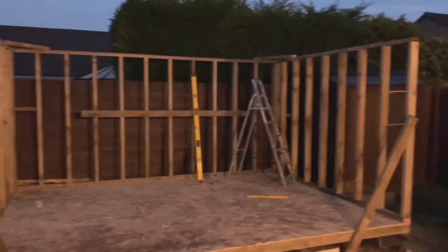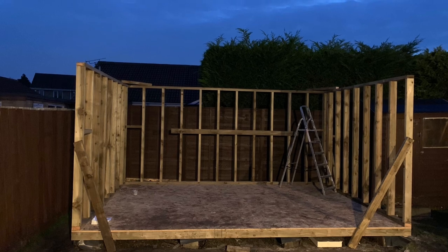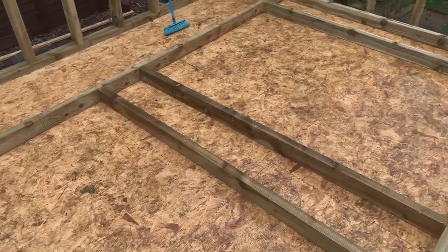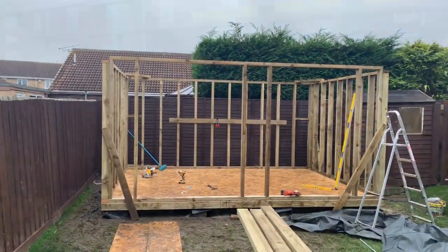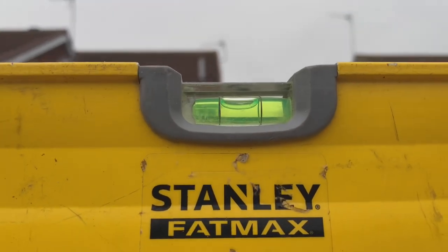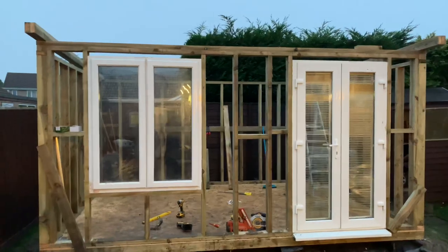As you can see here, I've got all three of the walls built at the same height. We've just got them stood up without any noggins in or anything for now — just get them sort of built ready. This wall is going to be the front wall, so we'll build that the same height as these, then just build it 100mm higher after by putting two lengths of 4x2 on to get up the four inches. Just checking it's perfectly level — which it is. We've stood the doors and the windows in as we're building it just to make it easier and get a nice tight fit.